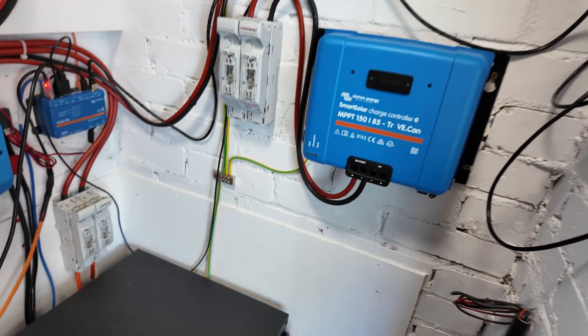The other option is to go to your council's building control department and ask them to come and sign it off, but they will almost certainly charge you an absolute fortune, so it is almost always better to get this done by an electrician. The other side of this is just a practical issue: solar panels are big and unwieldy — these 340-watt panels are about 1.6 metres long and over a metre wide. They're not particularly heavy, but how are you going to get one up onto a scaffold by yourself, hold it in place, and clamp it down? It's doable but a hell of a lot more difficult without another pair of hands — ideally two extra pairs.